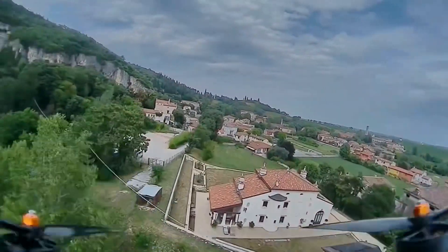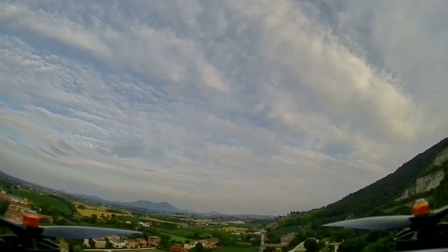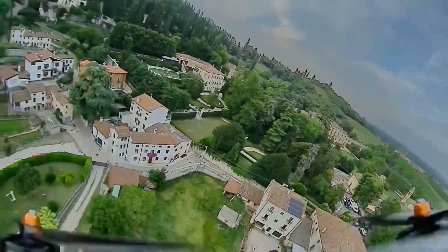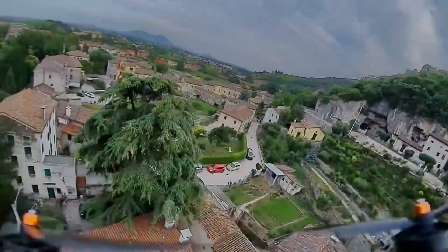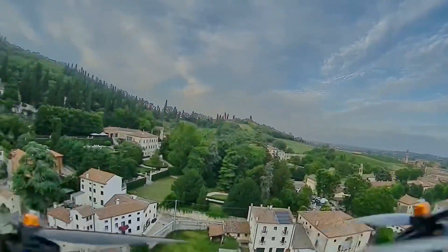This next flight was after my third iteration of tuning. I went into the blackbox, got all the filters right, and messed around with the PIDs. There's still a little bit of vibration when I hit the throttle, so I might tweak it one more time. But in the end I was just trying to see if these Stan FPV motors could handle a 7-inch prop — and they definitely do. If you want me to test something, let me know in the comments. Thanks for watching, and don't forget to like and subscribe.